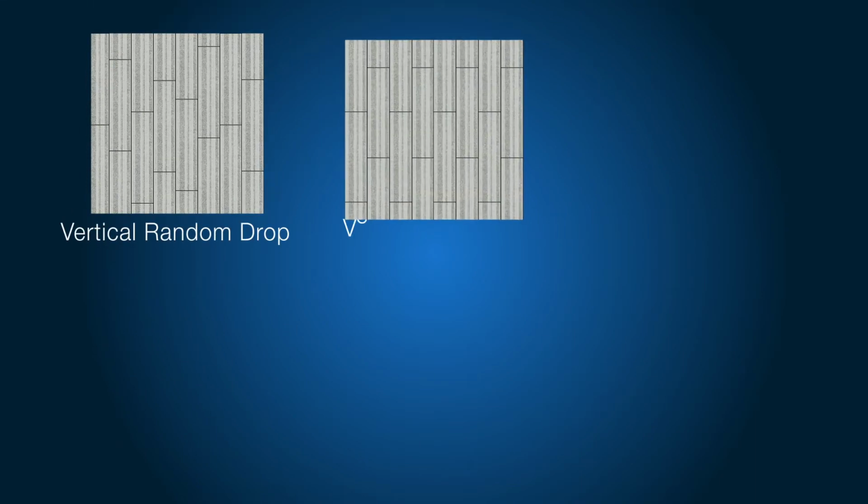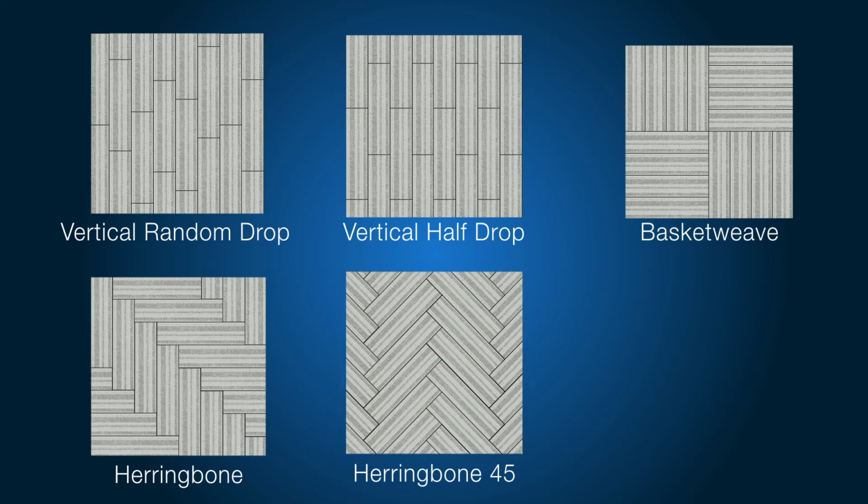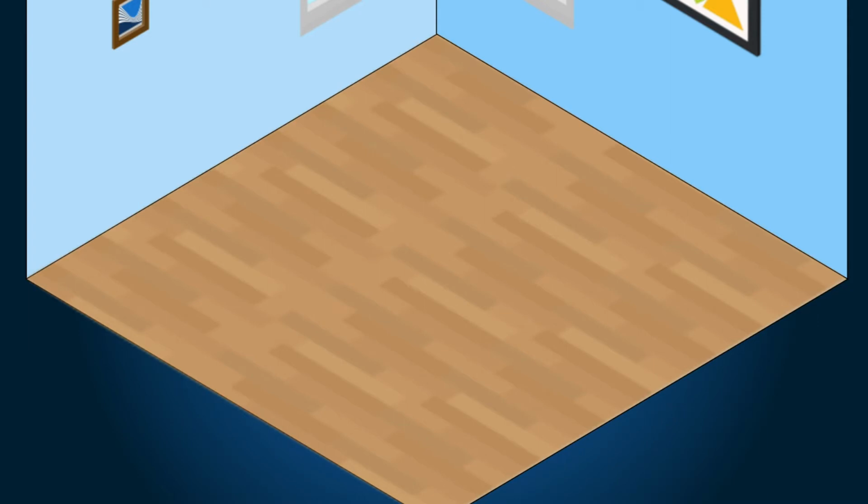There are a lot of really great patterns you can make using Foss Floors carpet planks. Try laying them out before you start sticking them to the floor and see what you can come up with. For the best results, mark a center line to divide the room and work outward from there. When applying the first couple planks, you want to align the edge with the center line you snapped.